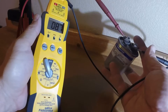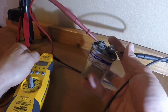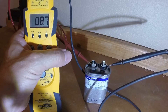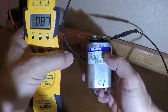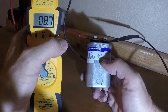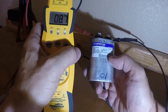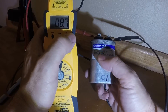It may take a few seconds to move up or down. As you can see, this one is reading 8.7. The majority of the time you'll see this bubble up on the top, and it's still really flat — but as far as our reading is concerned, this is bad. When it says 10uF, you have a 6% tolerance up or down, so it should read between 9.4 and 10.6. This one is reading 8.7, so that is why this is bad.